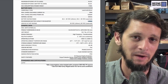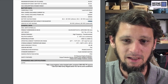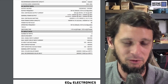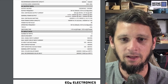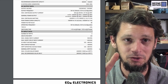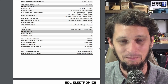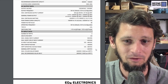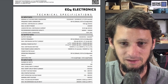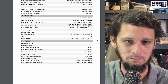It does recommend at least a 400 amp-hour battery bank, but that's 20 kilowatt-hours — if you're talking about a 12,000 watt inverter, you're probably planning on that anyway. This thing can do a 100-amp pass-through from the grid. A 200-amp breaker panel is good for 48,000 watts, and this inverter can pass through 100 amps — double what it can put out as just an inverter. You could put two of these on a house and have 200-amp pass-through with 24,000 watts of off-grid power if the grid goes down. It can also transfer 90 amps from the generator.